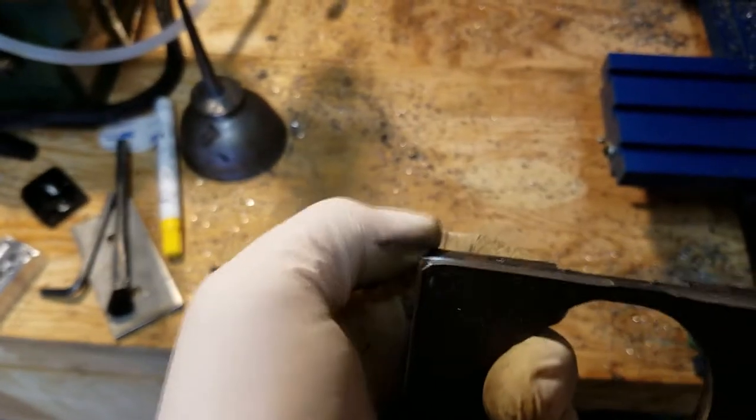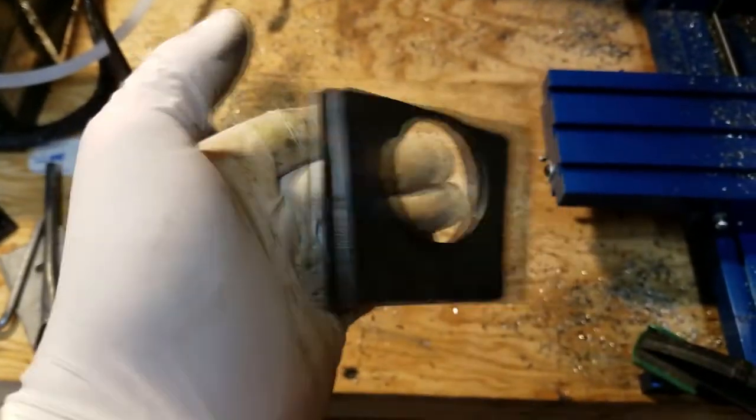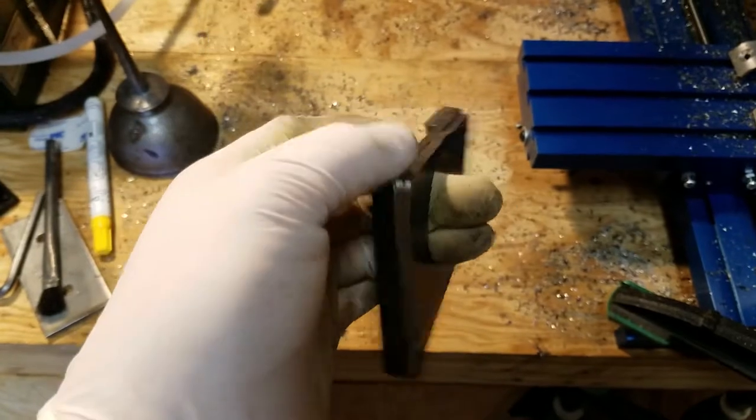We should still be able to pick up our G55 point on the part that hasn't been touched yet. So we will come back at this. We're going to have to use the 3/8-inch end mill, though. And it'll have to be tomorrow, because it's getting supper time.